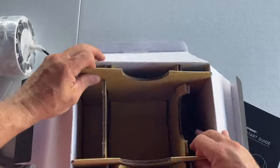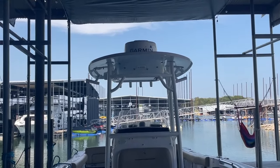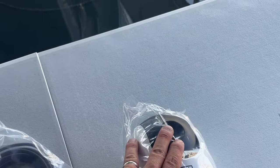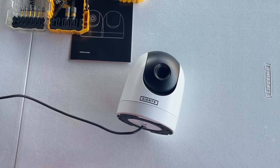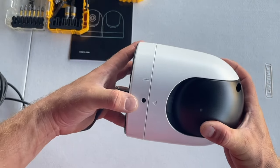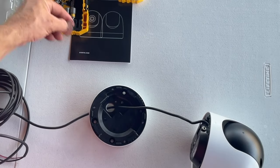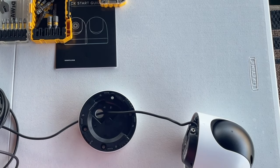On this boat I'm going to actually be mounting it inverted on the T-top in front of the Garmin radar. It can be mounted upright or inverted and you can adjust how it displays the video within the app. The first step in installing it is you have to separate the base plate from the rest of the camera. When it's unlocked it goes to that line right there, then it separates. There's a little grommet and a piece that holds the cable in place and waterproofs it.